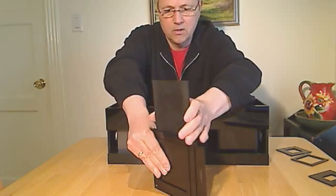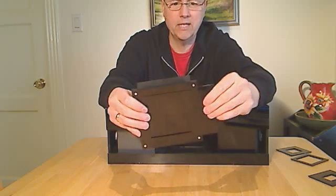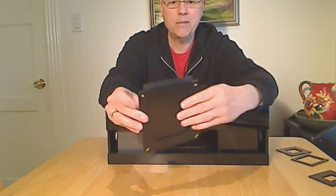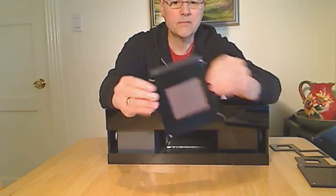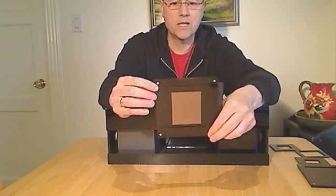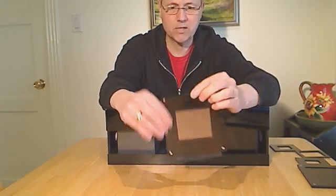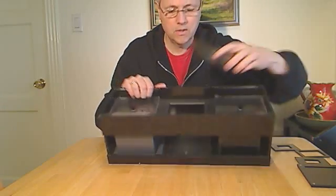You put your plate in in preparation for fuming, then slide the folding slide in and that keeps it in snugly. This secondary slide will open when it's actually mounted to the camera. That piece comes off during the fuming process and is just set aside. This then becomes the piece that fits into the fumer, and it's designed so you can rotate it in 180-degree increments. I may change the design somewhat so it could actually be rotated to each side, but it fits neatly into the top.